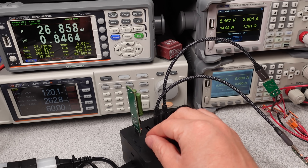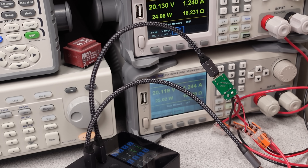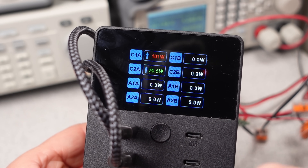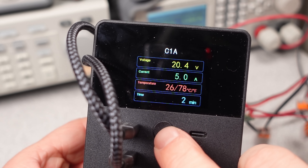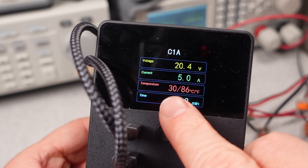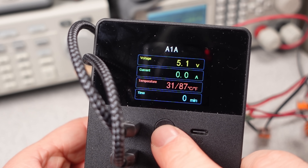So you can get 15 watts and no resets, which is very interesting. Another main feature of this device is the screen. It gives you the power levels of each USB port, and if you click through, you can see the details of each of the ports while operating. The screen appears to be quite accurate and does a good job tracking and indicating what each of the ports is doing. It is a little annoying that it turns off a lot — it would be nice if it was just on or dim, not off. But of screens in power adapters, this is actually one of the better ones I've seen.